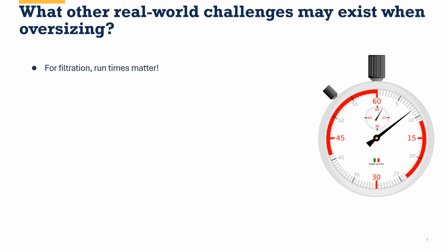For filtration, if you have an improved filter system on your central air handler, maybe because of wood smoke, or you're in a construction area, or you're near a freeway, or maybe it's just because since the pandemic, you realize you spend a lot of time in your house and you want to filter as much bad stuff out of the air as possible. Well, if you want to filter stuff out of the air, you have to have air moving through the filter. So the length of the runtime will matter if you actually want that filtration to happen.